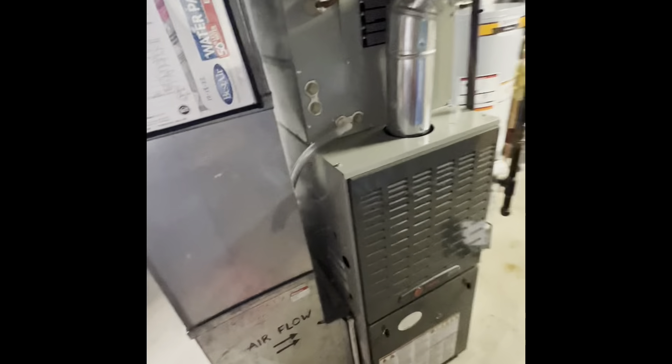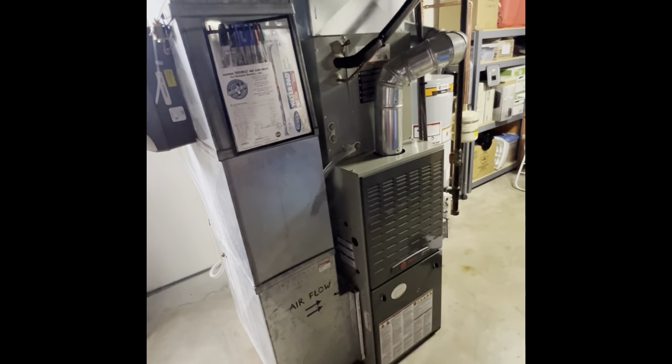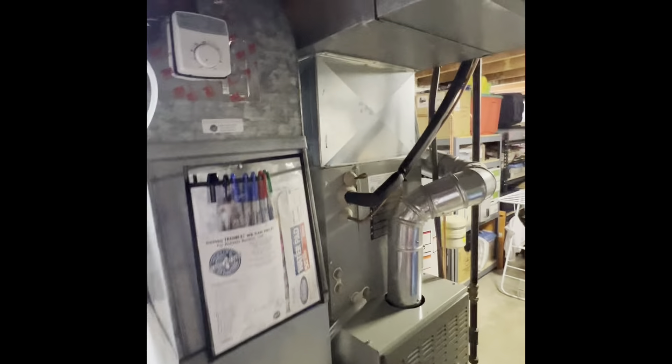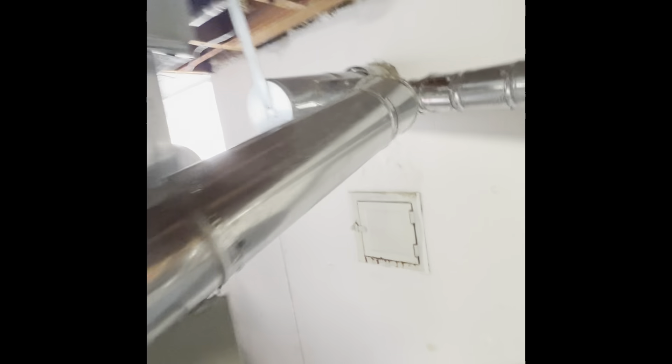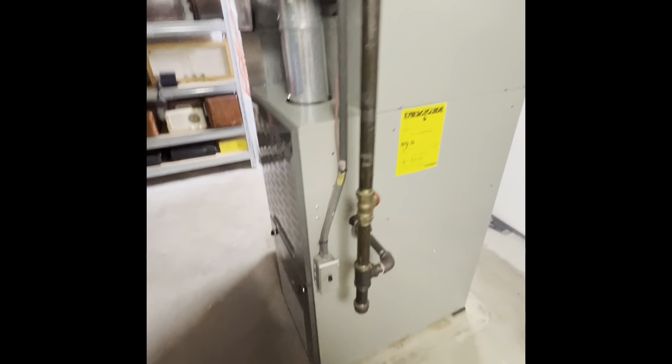Get our furnace on a base — the existing Trane furnace is a 40-incher, so going back with a 34 or 33 with a six-inch base will put us basically right where we're at. Looks like a two-and-a-half ton coil, feels like three-quarter inch line set. It is a lined flue — we've got a five-inch liner connecting to our four and our three for the water heater. Black iron pipe for our gas lines; we'll rework those with new unions, disconnects, and shutoffs. Electrical comes down from the ceiling.